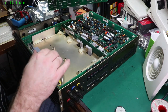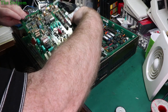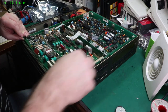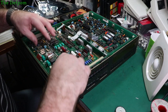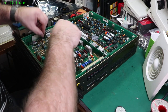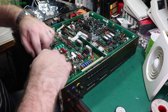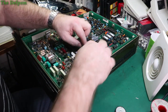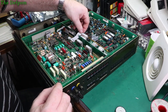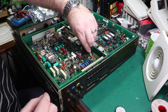Okay, let's put the board back in again. I'm touching the chassis before I touch the board inside it. I need to make sure I get the orientation correct - this has to go the right way around. I need to make sure I don't pop those wires underneath. I'm not aware of anything else which needs fixing on this board, at least not yet. So I'm not going to latch it down for now, just put it in place and use these posts to hold it down. Then I shall grab an MCT-6 and pop it in, and see if it works any differently.